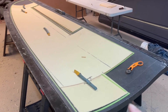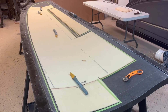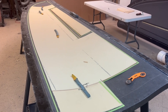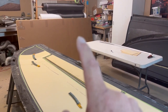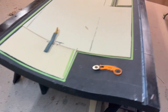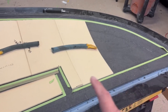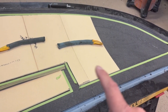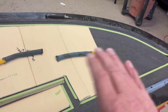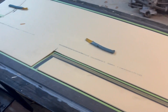I'm fitting the foam core that makes the inner ply of the sandwich panel for the wing skin. I was having trouble getting eight-foot long foam, but eventually a supplier came through and I've got several 4x8 sheets - they even delivered it. So I've got the wing core just about all cut and fit, with just the tip left to do. I'm going to remove that whole tip panel and do it all in one shot.